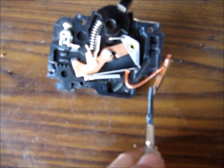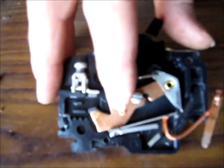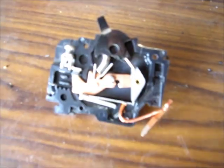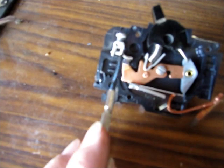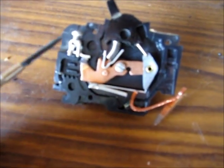I've looked at the internals of this breaker for a few minutes now and I think I know how it works. The power comes into the breaker right here from the power panel of the home, and then if the breaker is turned on, the power can flow from the panel through this metal plate here, up and into this terminal. This is where the power goes out to the receptacles or electrical services of the house.